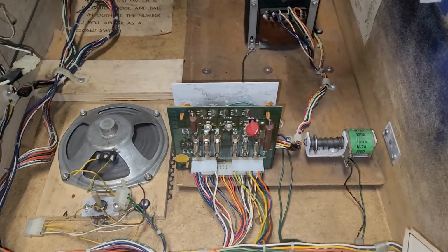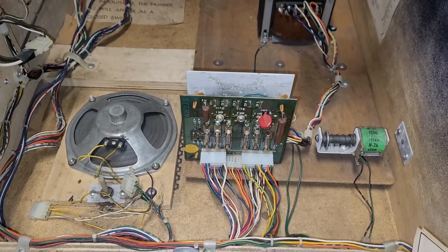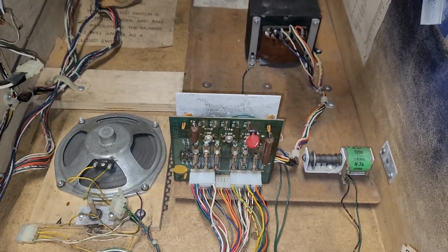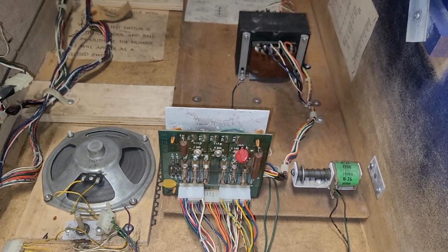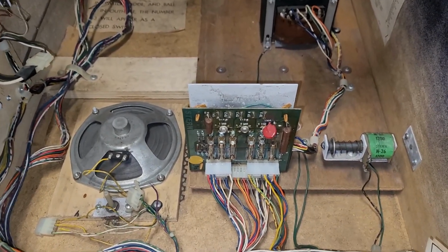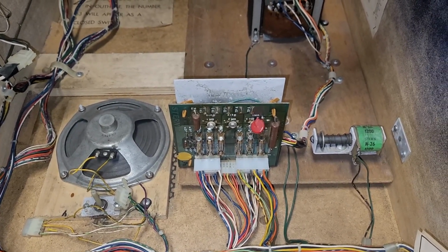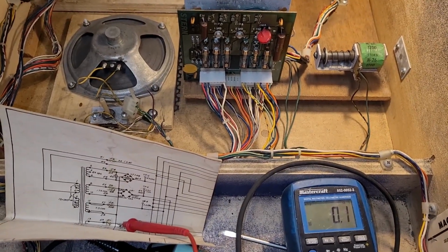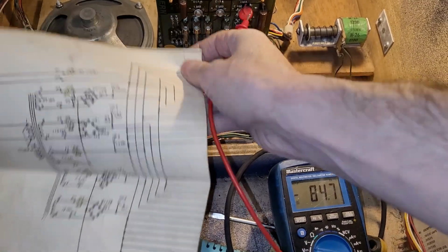But I digress. Okay, if this blows, then I'd kind of be happy, because then I at least know what's going on. Yeah, all right, there we go. So we know something on the solenoid driver is bad on the 43 volt line. Okay, excellent. We're discovering things and figuring things out. So I'll be back with a new solenoid driver board. All right, before I run up and get a solenoid driver board, we must check our rectifier voltages.